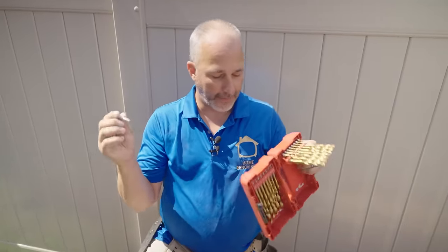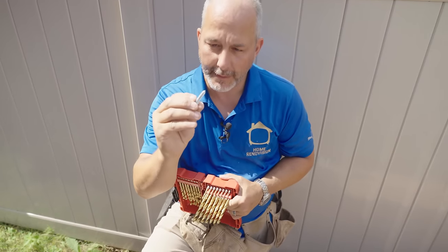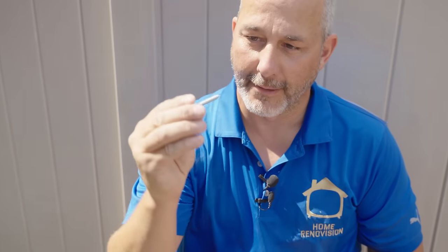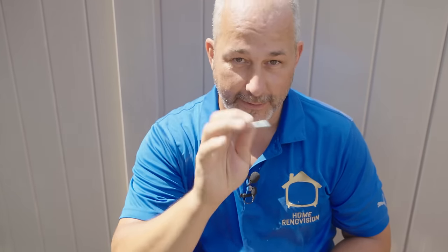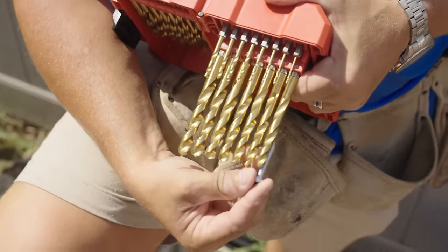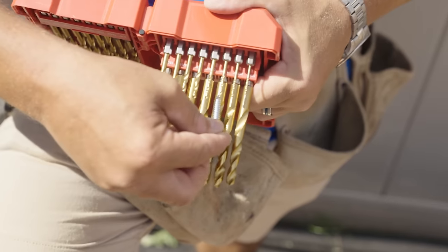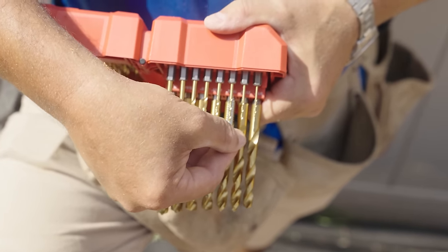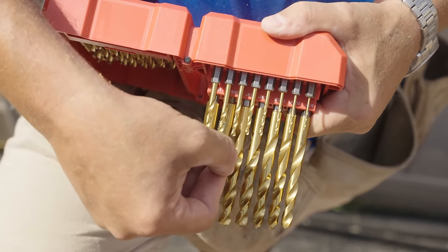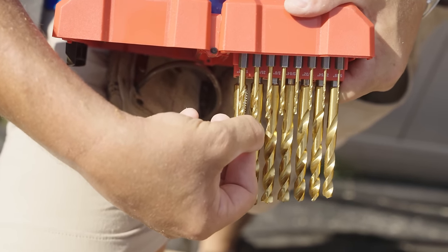All right, guys, I know I got a Milwaukee bit set. By metal, it's a really good set. Here's the screw I'm gonna use. The reason wood splits is not because of the threads, it's because of the shaft, okay? Now, this is designed structurally, approved by engineers and sold as a package so that you don't have to get it checked underneath. What you do is you put the screw underneath the bit. And if you can't see the threads coming out of both sides, then the bit's too big. If you can see the shaft coming out, it's too small. You want to just go along until you find the right size where you're drilling out just the shaft, but not the threads. And I think that's winner, winner, chicken dinner.